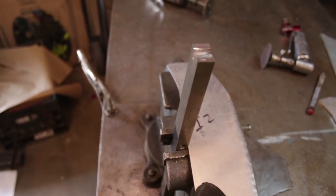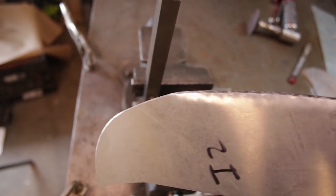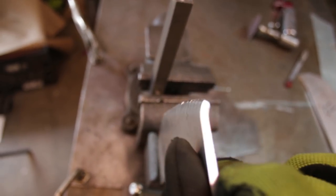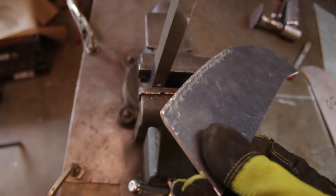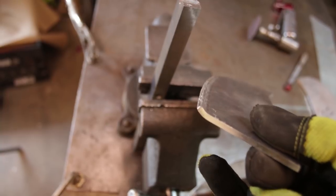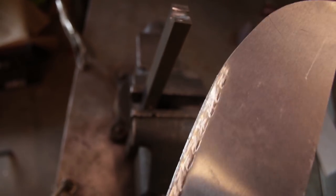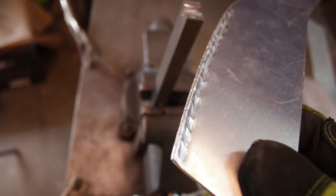Here's a quick progress report of how it's going. I have it started here on this mild profile, and it's looking pretty good. I don't need to go all the way around the corner. I just need to go a little bit and then have it peak in the middle where I can weld it and then file it smooth. On the back side it's a sharper radius on the inside, and that kind of follows the shape of the die that I made. The marks are helpful so I know where I've been and can keep going at it. This piece is not as long as the previous piece I tested, so there's not as much leverage.